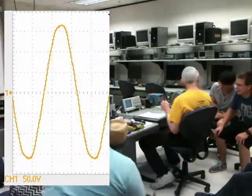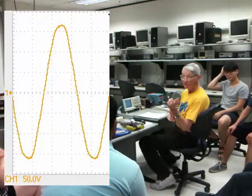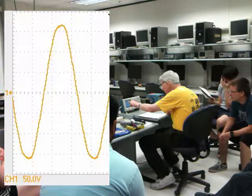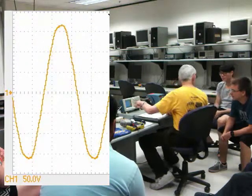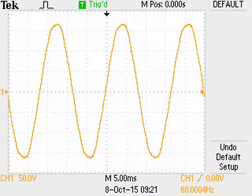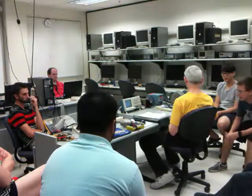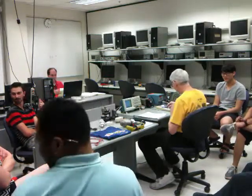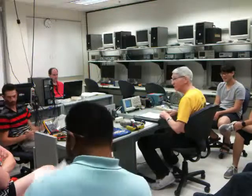What do you think? What should it be? 170 you calculated? Yeah. 50, 150. And so there's 5 little ones, it's probably 10 each. So 160, maybe close to 170. That looks right. You set the probe correctly, and so we got the right value. So that's the first thing. We calculate it, we generate it, we verify it. Someone else generated, we verify it.